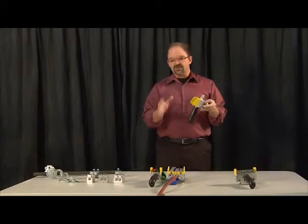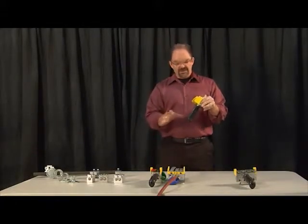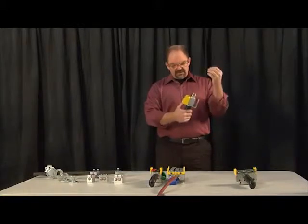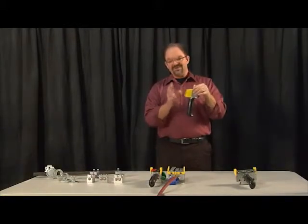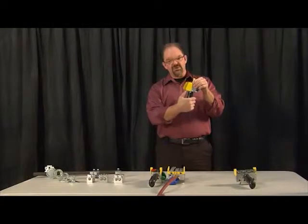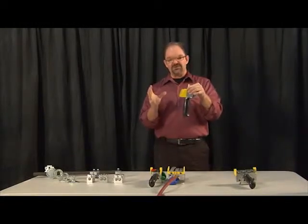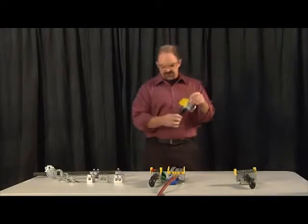On the other hand, with the spool valve, which you just saw me use here on the Gorbel handles, the incoming air comes in adjacent to the valve, so the valve is always the same. You get a good, smooth depression force regardless of incoming air pressure. So you're able to use that good control without any significant change in the startup and the movement throughout the entire stroke.